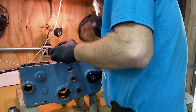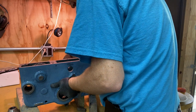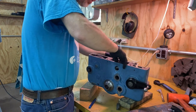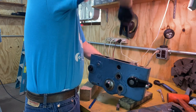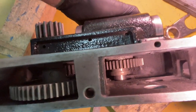And this gear slides onto that with the shifter part facing forward. And again, the gear fork, and I think I'm gonna be able to put the gear fork on after this gear is installed by putting it in and then swinging it sideways. That's what I'm looking at down there, trying to get that all lined up.